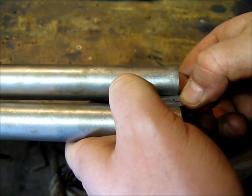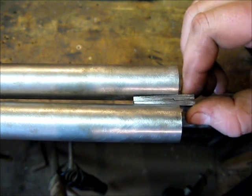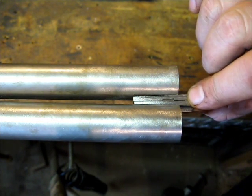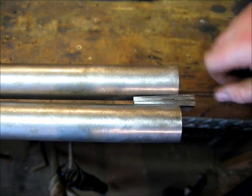For now this will just get temporarily soldered in place. Then I'll keep working on the rib work and the other parts. This is the first part I'm making this week — I've got to make another one for the other set of barrels. This is the most important part for regulation: making a split wedge that goes both directions and allows you to move the barrels in any direction you need to.